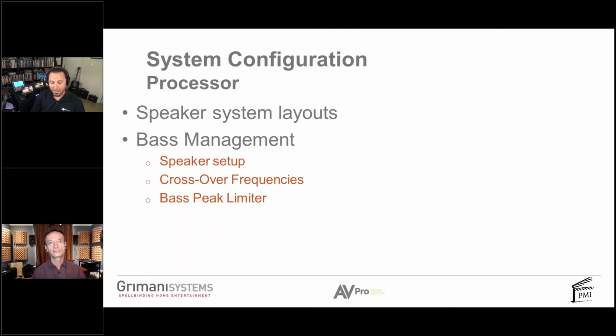A good tool to have, I think every installer should have, or calibrator or programmer, or anybody who works in our field, is some sort of little test monitor like this, because we run into video systems all the time where the projector's out for service or the TVs haven't shown up yet. So we have to test infrastructure. We have to make sure signal's getting there. So these little test monitors I've got back here, there's portable ones, battery-powered ones. Every installer should have something like that.